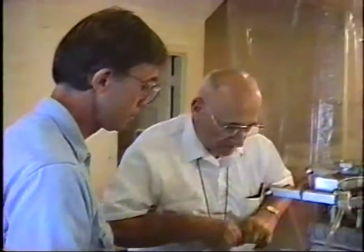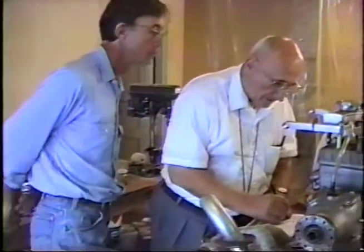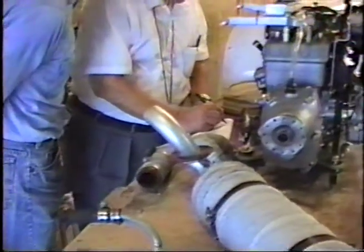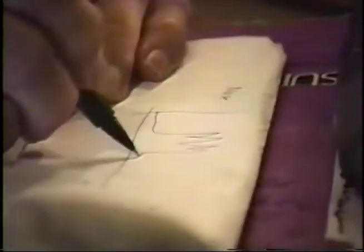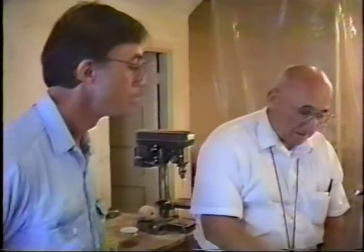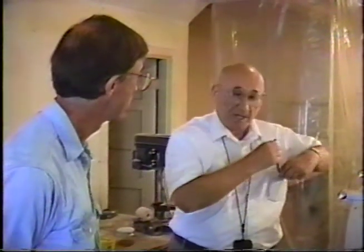As a matter of fact, it looks like this: if that is time and that is the noise level — it goes like this. Each time the blade comes around you have that spike. This amounts to a very high value, which gives us cause to think that perhaps the increase in air drag because of the propeller is even more than what we first thought. And that is my reason for using the pusher propeller.